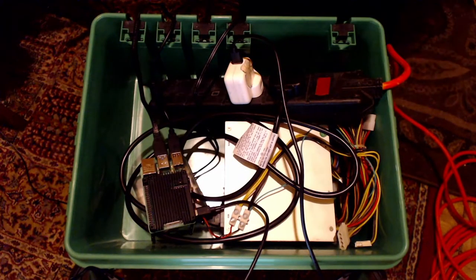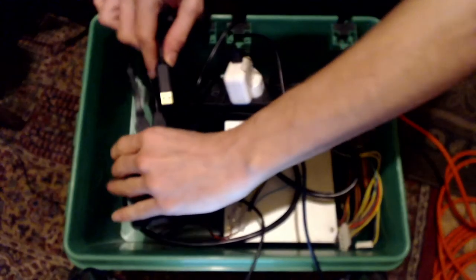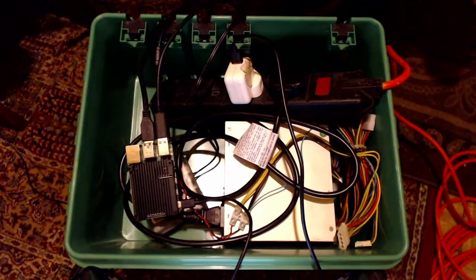There's also a USB 2 to USB-C cable that I use for the guide camera, which I'll plug into a USB 2 port. I connect the guide camera directly to the Raspberry Pi rather than into the main ASI1600 camera, to provide more bandwidth for the main camera to download images.